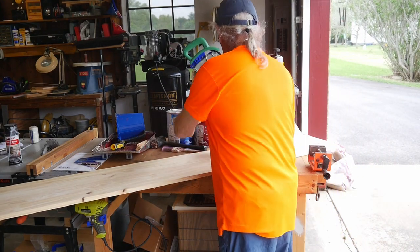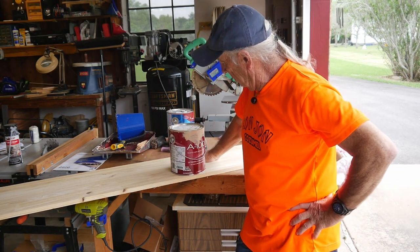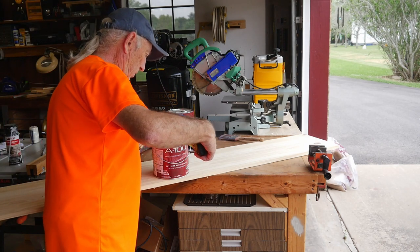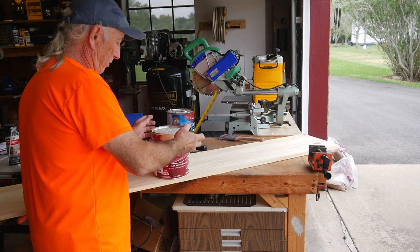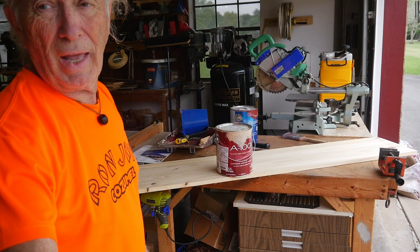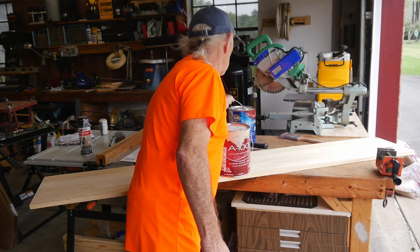Today we're sizing the shelf. Here's the board and these are the big paint cans. They take up a little better than almost half the board width. The paint can measures just a hair over six and a half inches, and the total board width is twelve inches. If I cut it to six inches, I'd have about a half-inch of paint can overhanging the shelf — and honestly, that half-inch overhang wouldn't even bother me. From the floor you'd still look up and see the paint cans clearly.